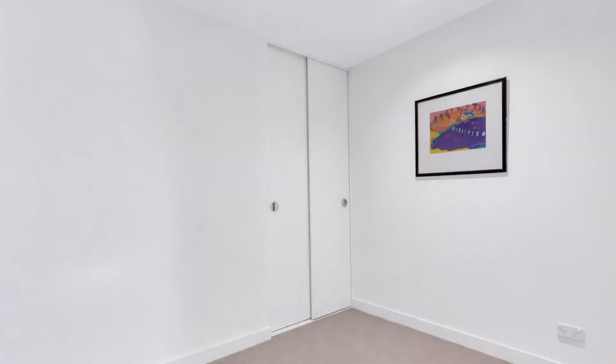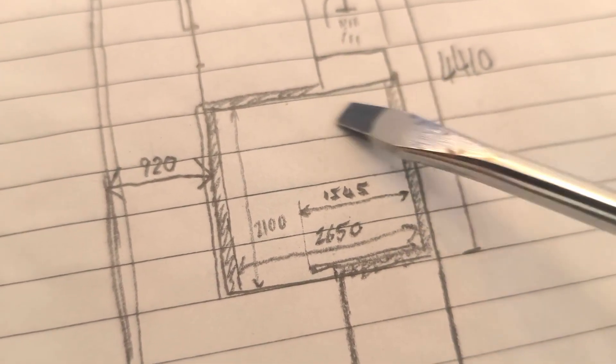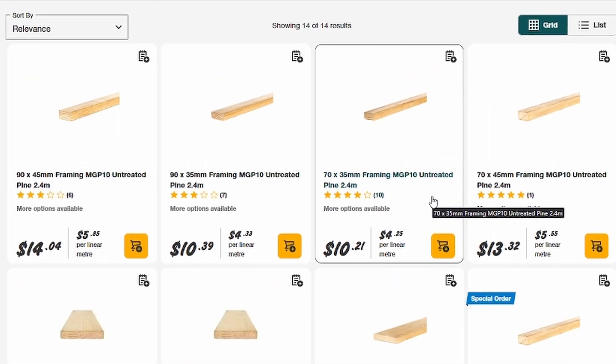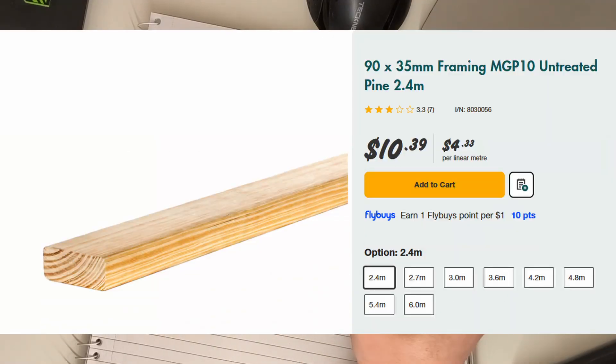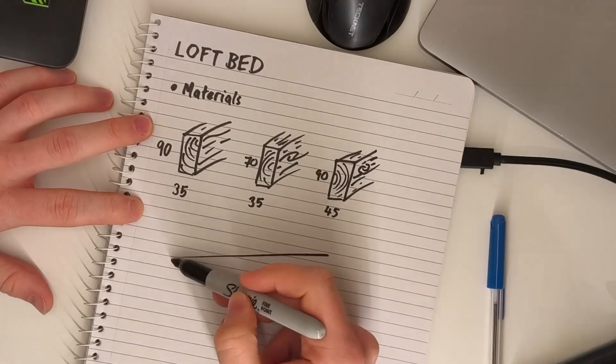This is the small room I was building it in. It has a wardrobe in a corner that can't be blocked off. The room is only 2m by 2.6m so it's not very big. Before starting my design, I needed to know what materials I had available. I took a trip to Bunnings to see what timber was in stock. Selecting the right material was quite important here. I chose to use 90x35mm framing timber as it was much cheaper than the 90x45mm and still offered great strength.